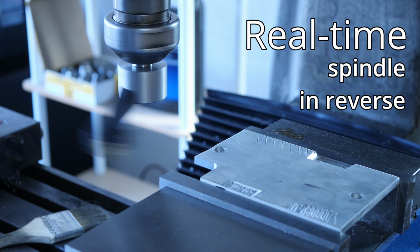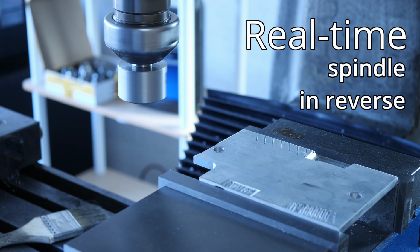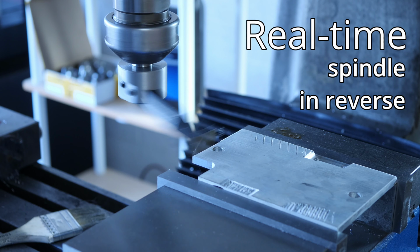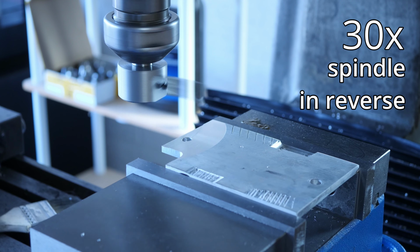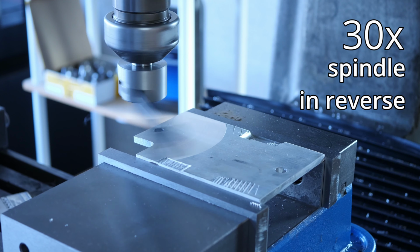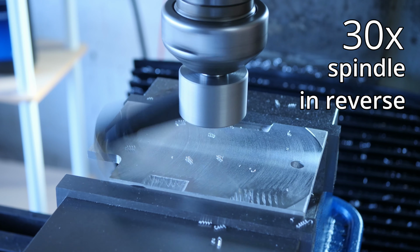You might recognize this piece of 6061 aluminum from my video about the Barker Mill CNC conversion. I started off a bit too deep. It was working, but I didn't love the sound of it, so I raised the quill a tad for a shallower cut. Once again, the table power feed came in really handy. I could just let it run while I stepped back and admired the cutting action. And it worked almost flawlessly.